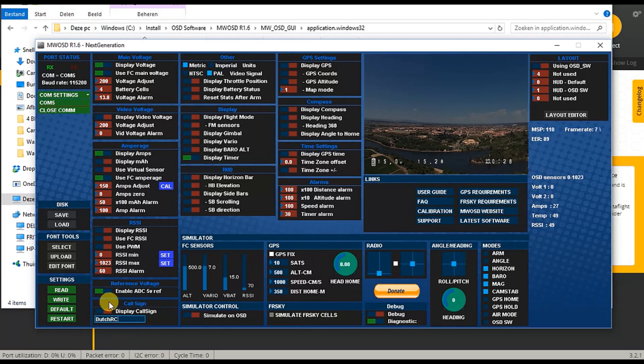Basically I'm pretty sure we won't see amperage, so I'm going to disable that. Where can I enable the callsign? Oh, here. There we have got a callsign. Where does it display? Oh, there. Okay, we've got a flight time — that's okay — and we've got a battery voltage. I'd like a crosshair here in the middle. There, that should do. Basically this is all I need: a voltage, a callsign, a flight time, and a crosshair in the middle. This is the OSD setup I want to use. With that all said, let's go and fly the crap out of this quadcopter!